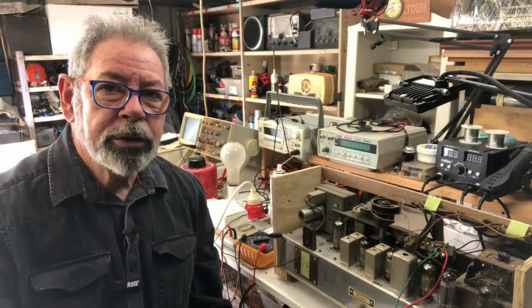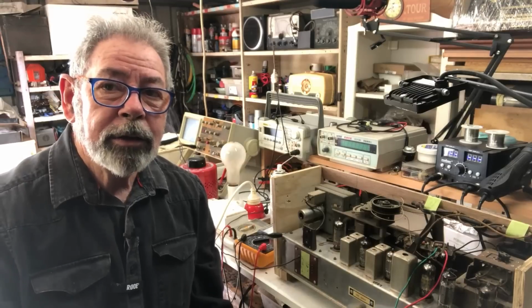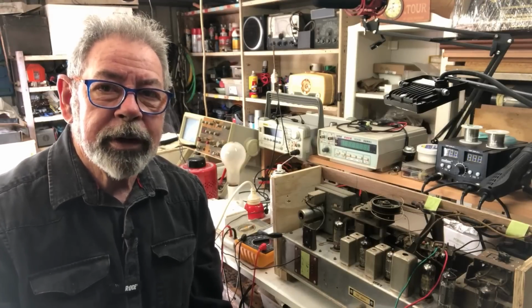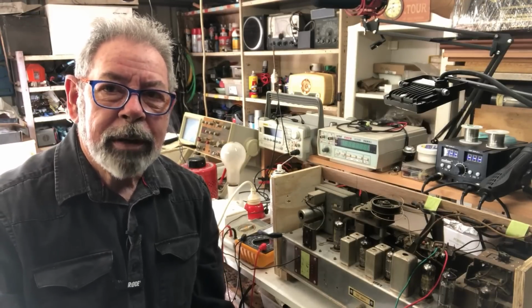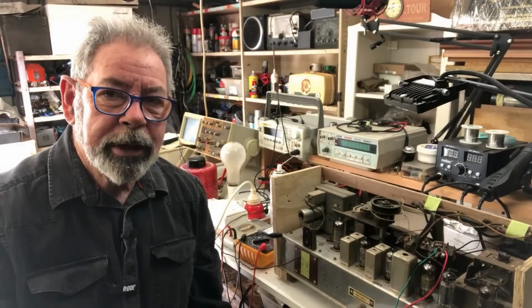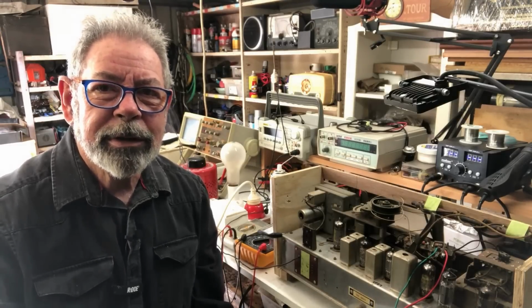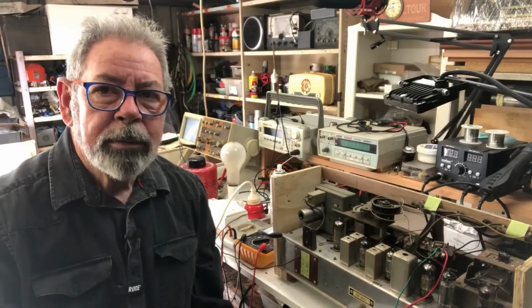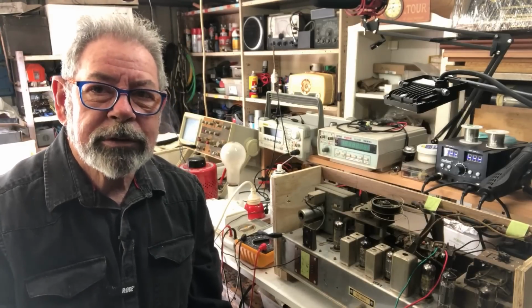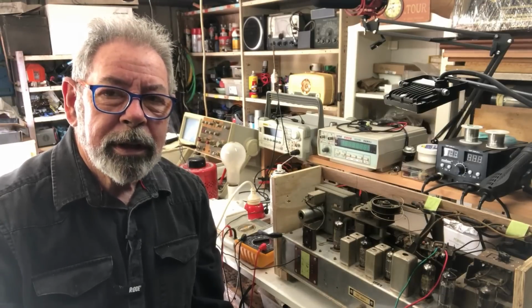This is part 2 of this Bush VHF64, and it looks like it was once a very nice radio, but gee, there's a lot of work ahead of me with this one. In part 1, after checking it out thoroughly, I powered it up and got some very limited AM reception. No reception on FM at all, but that's not surprising because it's full of those nasty little Hunt's capacitors, all of which will be leaky.